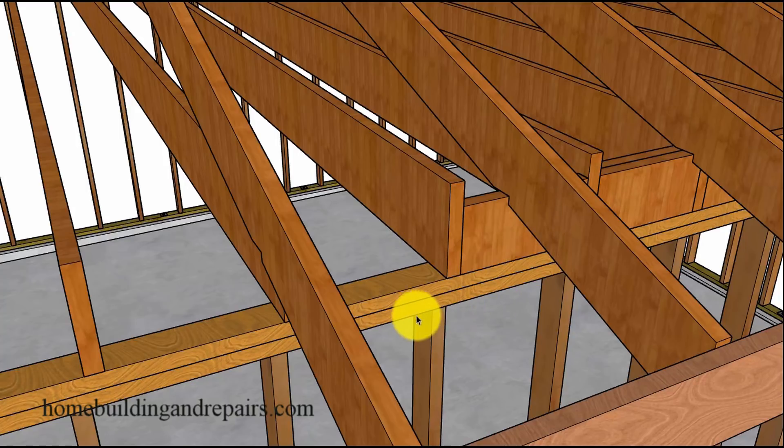You might need to remove the outside wall finish — for example, if you have stucco or siding, you may need to remove the top section of it. Otherwise you're going to have a difficult time getting the joist in, nailing it, and attaching everything. That's another thing to consider depending on what you're working with.